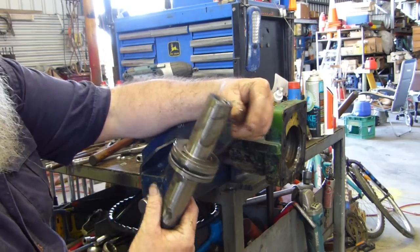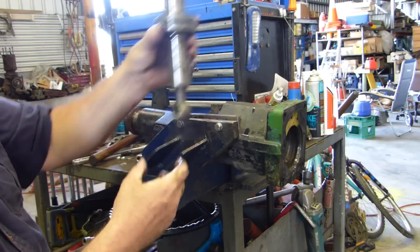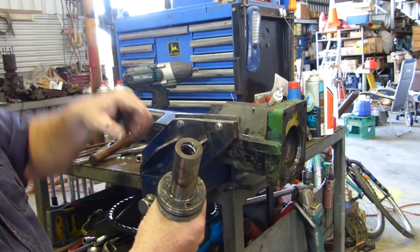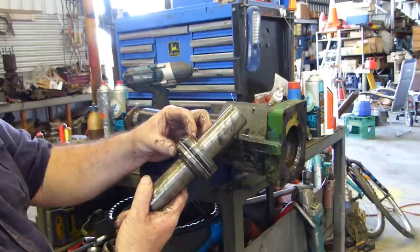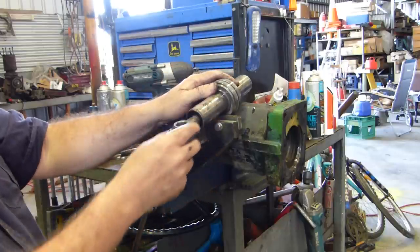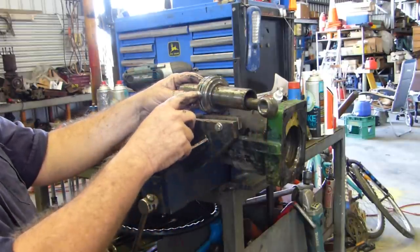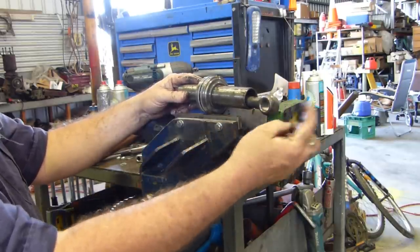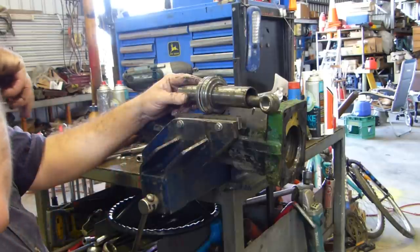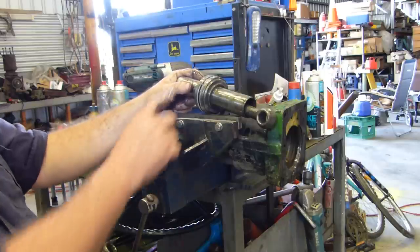This is your main piston. To get the main piston off, you can see on the end there there's a couple of holes. You need to hold this and there's a round socket that sits on here - two pins go in and you can undo it. That unscrews; there's a thread in there. I've had them when the tractor's only turned one way that this has come unscrewed. We call this a dog bone because it looks like that at the other end as well. There's another pin that goes through here, and from time to time these dog bones break or break up on the inside. If that's the case, you need to get this piston off. We don't need to do that - there's nothing wrong here. If you're just resealing it, there's no need to go any further, apart from replacing the o-ring and the backup.